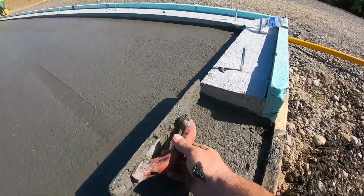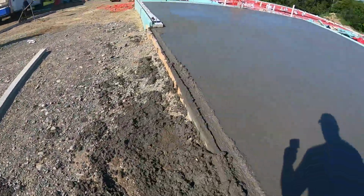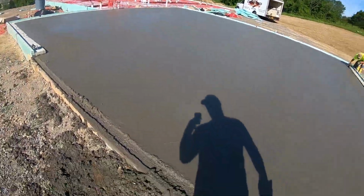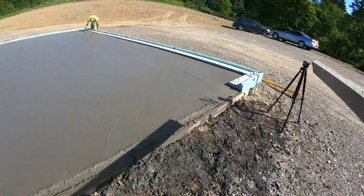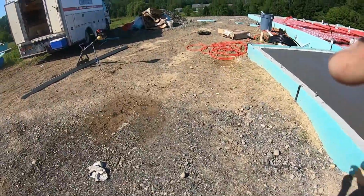So when the garage doors sit here, the water hits the garage doors and goes out from the seal. And then I take a straight edge like that and get it in my trough and work it up so it's all, work it right on up. Get you real quick before this battery dies here. So this is gonna sit here and I just screed it up so everything will stay true and then it will hit that seal perfect. All right, I'm gonna charge and then we'll check back.